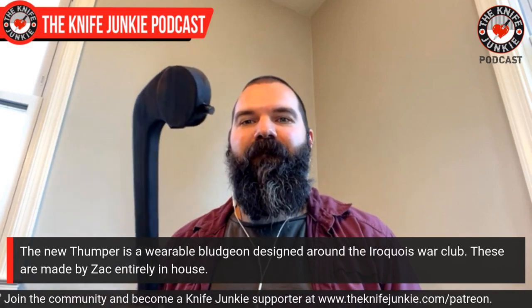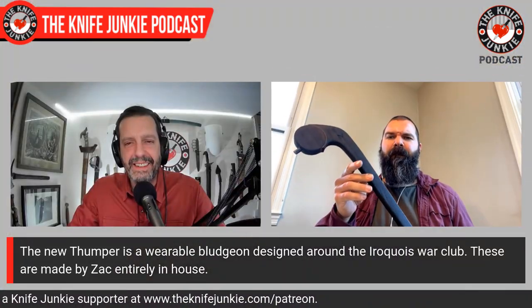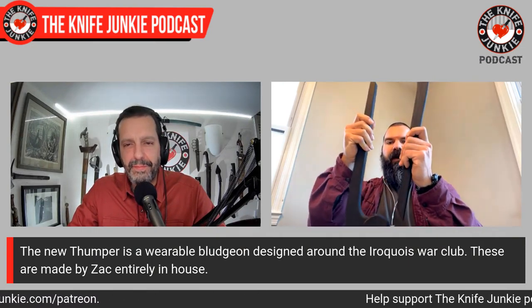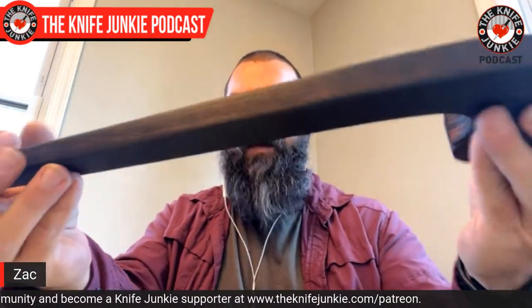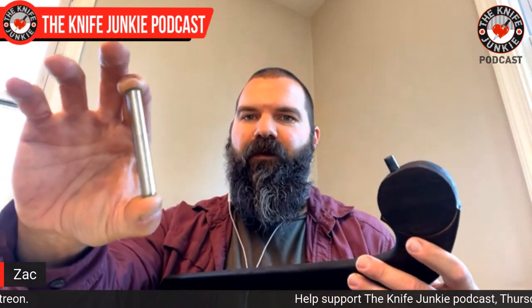This is the Thumper wear club. We had a naming contest — 'wear club' with an extra E because you can wear it. These are made from Pennsylvania hickory, nested in a board and CNC'd to near net shape. But CNC wood has rough machining marks, and a war club should have a textured grip, so I hand-scrape and rasp these for texture. Then I soak them in boiled linseed oil, take them out, and torch them slowly — that's called a shou sugi ban-type finish, a Japanese style of wood finishing and waterproofing.